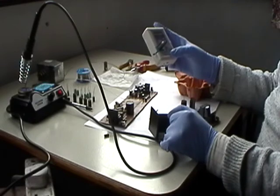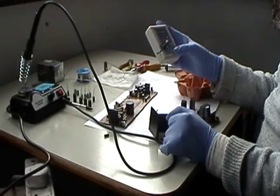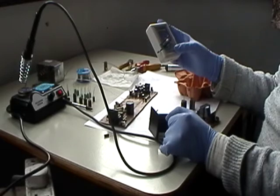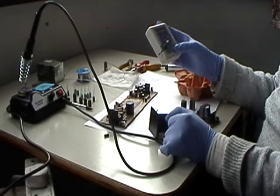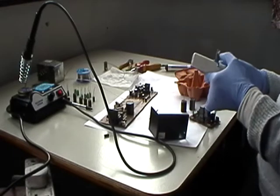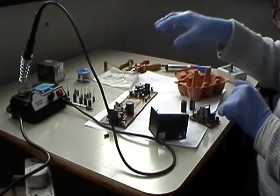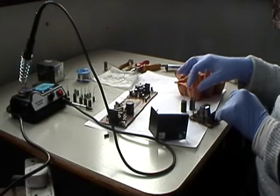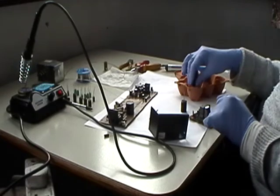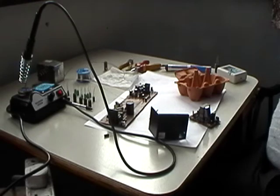Let's have a look there. Well, it was bad yesterday. Yeah, that is low. It should be 2,200. It's only coming up 1,595 microfarad, and ESR is 1.6. So basically, it's lost its capacitance slightly. So what we'll do in that case, we'll put in whatever we have, carry on doing whatever we're doing over there, and we'll leave this one out for now, because I'll have to find...